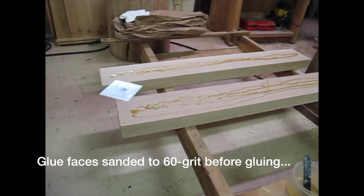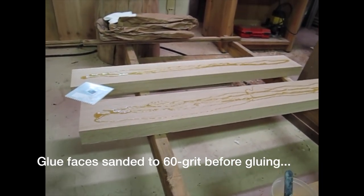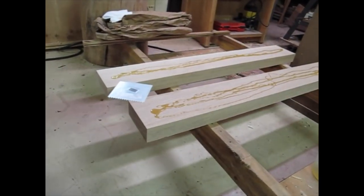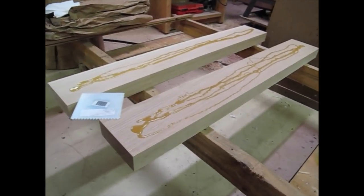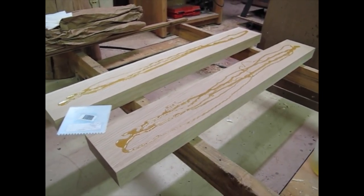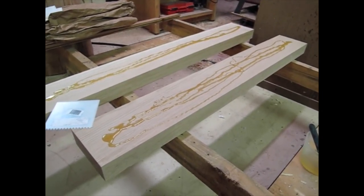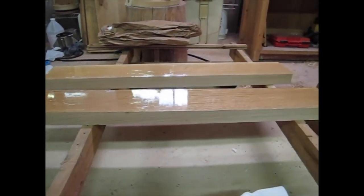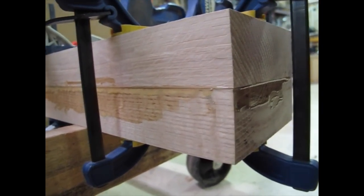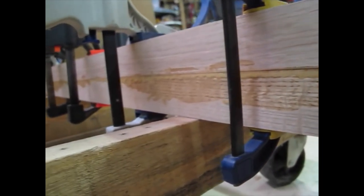This is gluing up the new Samson posts with West System G Flex Epoxy. It might not look like a lot of epoxy on the surfaces, but I've already done one of these and just putting that little bit on still got a lot of squeeze-out. It's a nice tight joint. That's everything spread into a nice thin layer, and here we can see squeeze-out all the way around the joint.